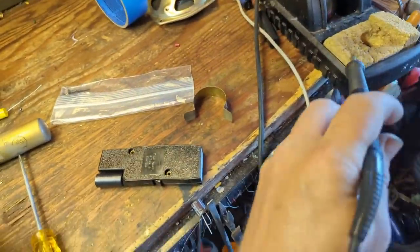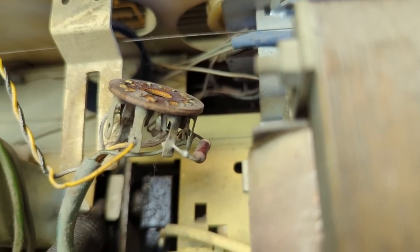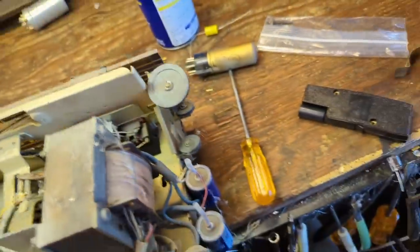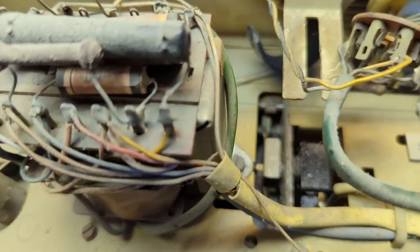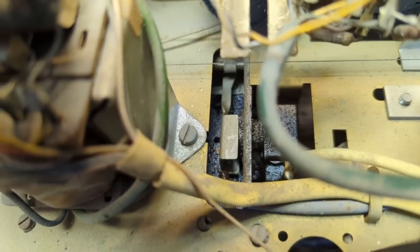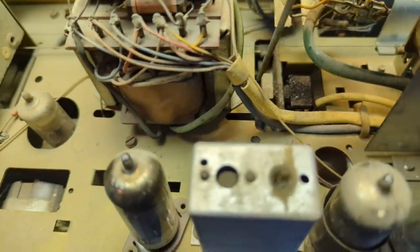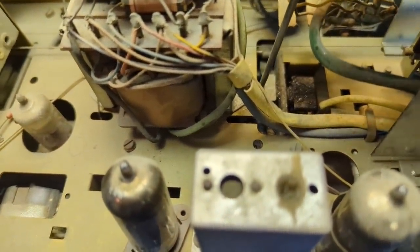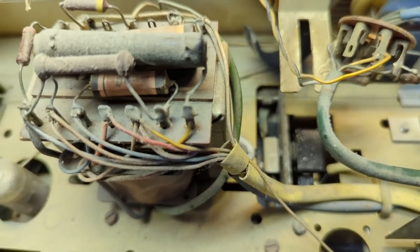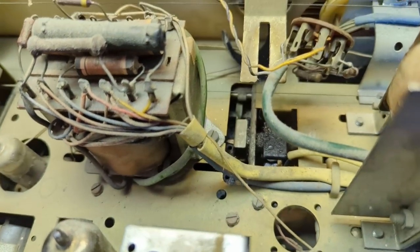Here's the switch. I've soaked it in WD-40 and then I'm going to get the end of the switch hot so that can help work it loose a little bit. Sometimes you just got to be real patient with these guys - don't try to force the switch. If you do, you'll break it and then you're screwed. But sometimes it takes a few times of just going back and forth. The on part seems to be doing great. Seeing as the switch is actually switching, I'll have to get out my multimeter.